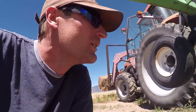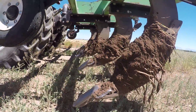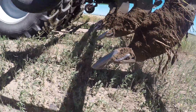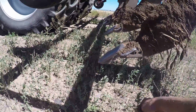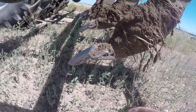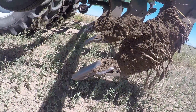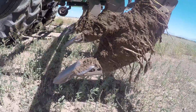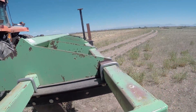Here's a look outside. These shanks are what's going into the ground — these things are about three feet long. We set them down about 20 inches in the ground and these points right here help break up that compaction. They loosen up the soil so it's a lot easier for plowing, and they get a lot deeper than the plow to break up what we call a hardpan, which develops underneath the soil. These clays compact after a while from driving over them, so they need to be loosened up. This bad boy's about 20 feet wide or so.